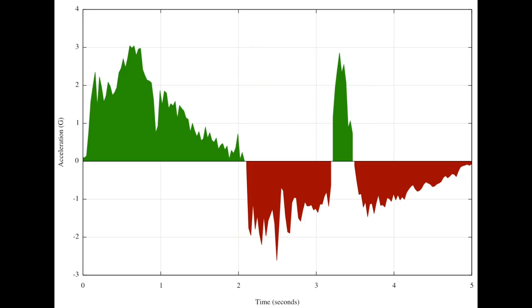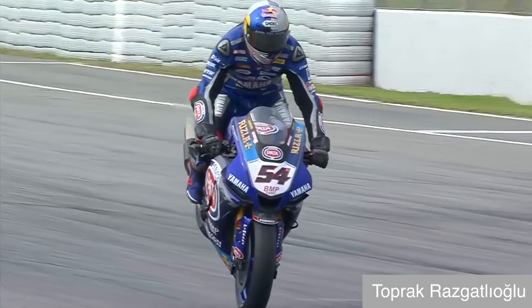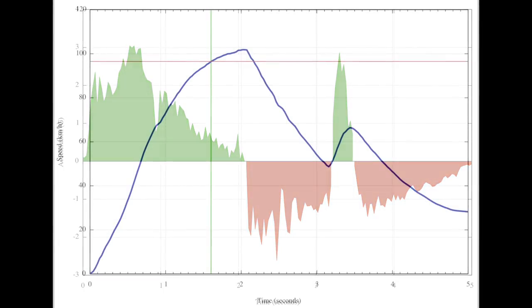Here's the horizontal acceleration trace. It pulls 2G until the hull lifts clear of the water, then 3G once it's prop riding, before the motor hits its maximum revs and the acceleration drops off. Here's where the ESC cuts out. It slows down at over 2G. No wonder the old sponson dug in when it slows down. It's similar to a bike doing a stoppie. Then the ESC wakes up, and we're pulling 3G again.